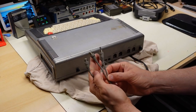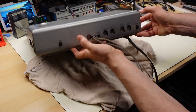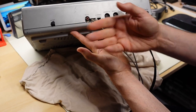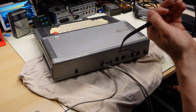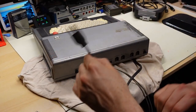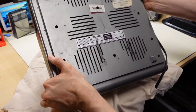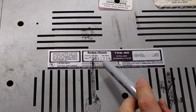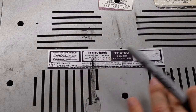There are three extra cables that run out the back of this machine. Looking at the ports: joystick right, joystick left, serial I/O, cassette out to TV — RF out — and there's a channel selector switch. All TRS-80 Color Computers had built-in power supplies. There's a power switch and a reset switch. This actually has a grounded plug — I'm pretty sure my CoCo 2 and 3 only have a two-prong plug. The serial number on the bottom is 41214, which might be a low number in the sequence.